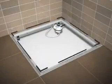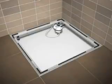The tiling aids make it easy to accurately tile the wall and floor without having to insert the shower tray into the ESR. Affix the special support rubbers to provide better sound insulation for the corners and long sides. Now insert the shower tray and connect the siphon trap to the shower tray. Seal the edges of the joints with silicone sealant.